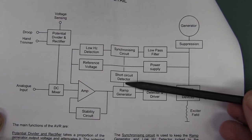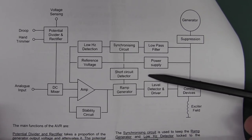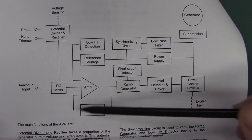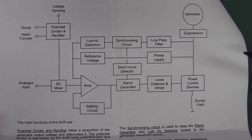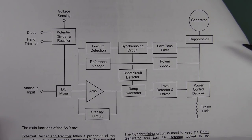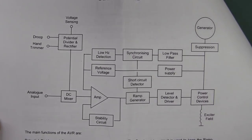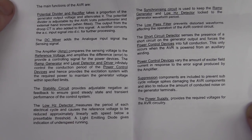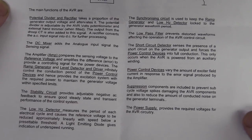If this is the block diagram, you've got things like a short circuit detector — so maybe you've got to short the output and make sure it does its business. There's stability control as well. If you wanted to really check the specs, you might have to check the output stability and droop functions. But I don't know enough details — you really have to read into it to know how much you want to actually test on this thing.